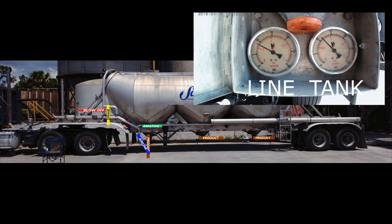If you forget to drop the airbags as the trailer sits there, the airbags will lose air pressure with all the weight on them and slowly push forward and up on the landing gear, binding them up and possibly causing damage to them.